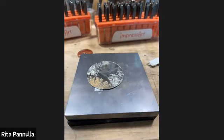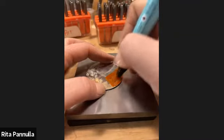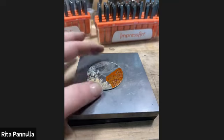Further troubleshoot it. I don't know if maybe your brass blank was tarnished before you started stamping, maybe it needed to be polished. The makeup of these blanks, they are not plated. They are a jeweler's brass, a jeweler's copper, and alchemy. The silver is either aluminum or a tin-based alloy similar to pewter, which is called alchemy. The best thing about these blanks is the copper and the brass are jeweler's quality, so you could always polish them back up. I'm not sure if you have a little bit of tarnish on the back of your blank, but if you could send us a picture, we could better help you with that.